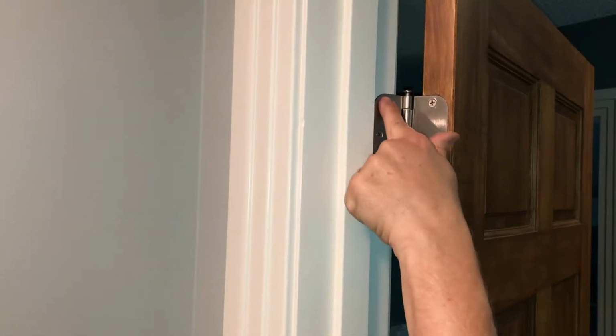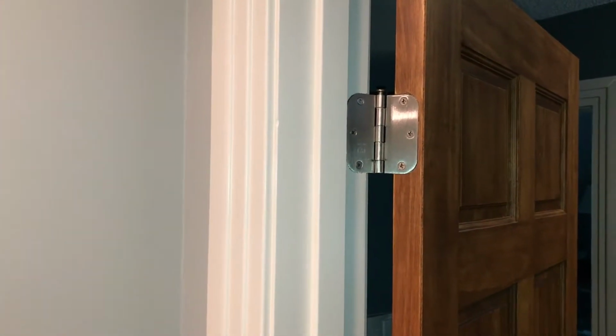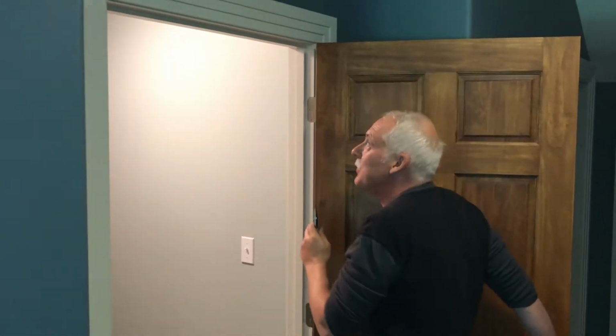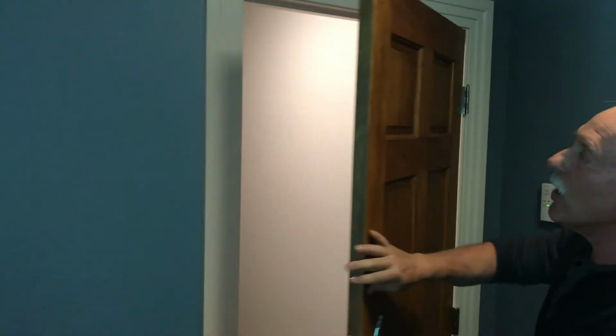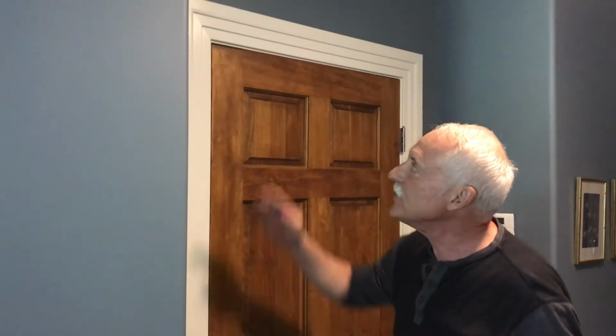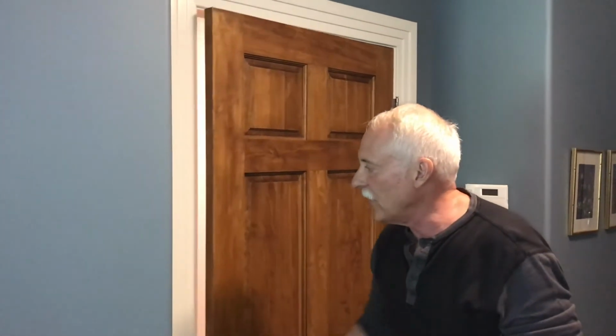Now we crank that screw tight, it's grabbing hold deep in that wall now onto a stud, and let's see if it worked. We got that screw tightened back in on the top. Now we're going to see if what we did just by tightening in and going into a longer screw, whether it got rid of the sag. There's no grab anymore. It brought it over just enough so that we don't have that catch, so the door latches very easily. That's a quick fix with Rick.